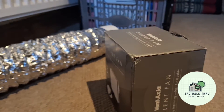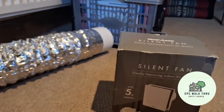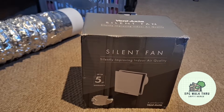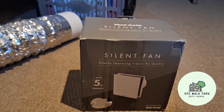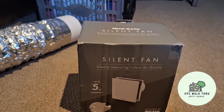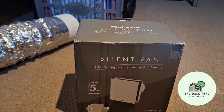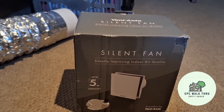We've got two opening windows upstairs but it's pretty airtight since we haven't got any open chimneys. It's an older house and the walls aren't that well insulated, so the humid air touches those walls and causes black spot mold. We just don't want any humidity up here, so I'm going to install this fan.